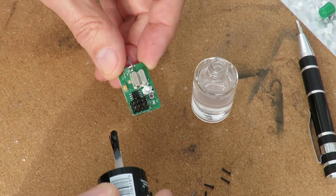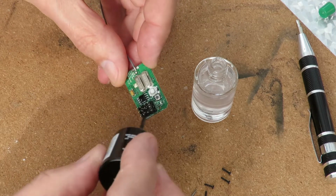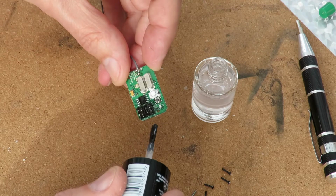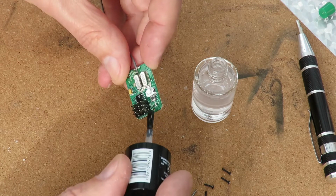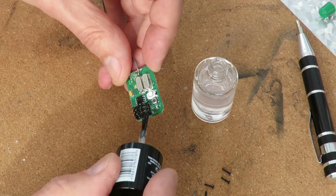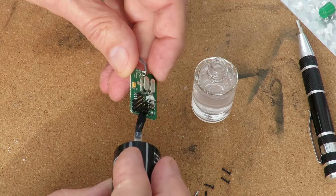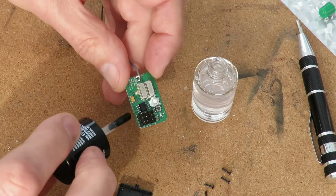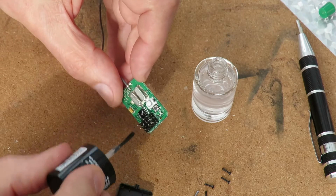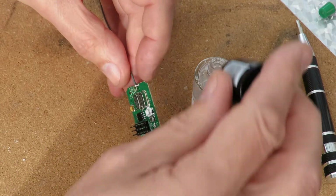I have found in the past when I have got my receivers wet, it's usually around these pins. Now getting the pins wet isn't a problem, it's when you get the crystals build up between them. I think the only way to cure that would be to get the nail varnish right underneath, and it doesn't really flow that well, so I can just do the best I can.